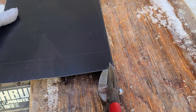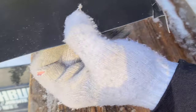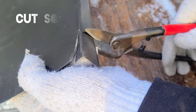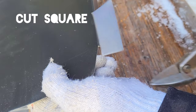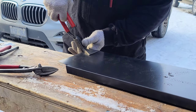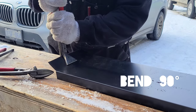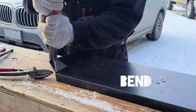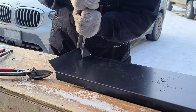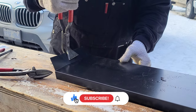We're gonna notch the back piece at an angle. When you're doing this notch, we're going to square off the back and finish it off with a 90-degree bend using your folders. Bend it up 90 degrees — this will make it nice and easy to secure with a fastener.